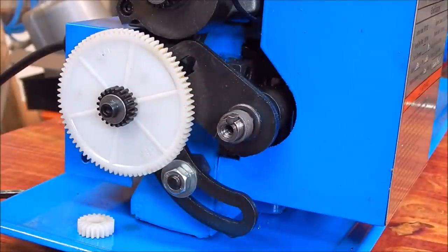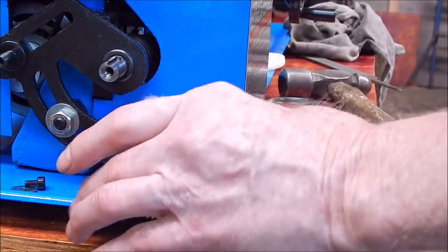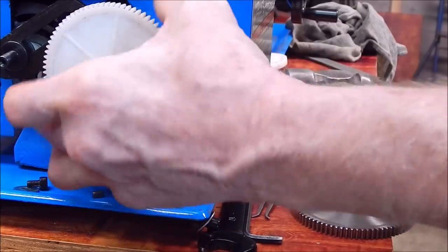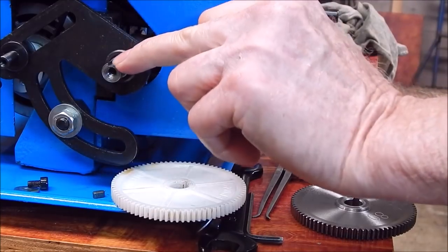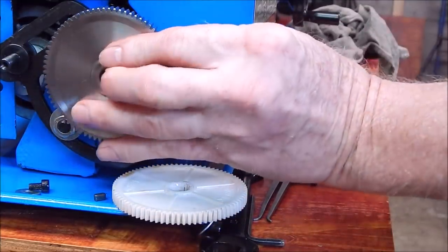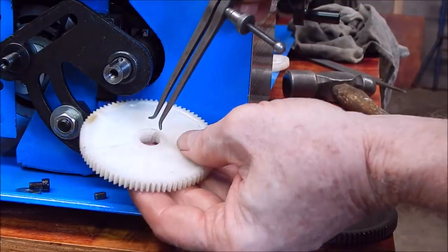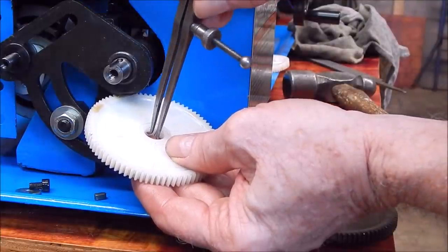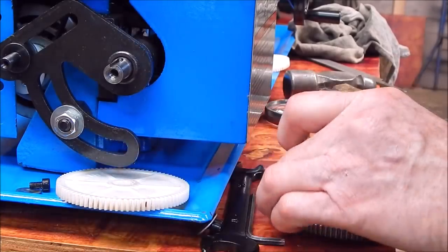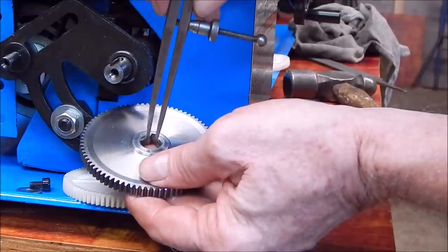Okay, let's get an 80 tooth and put it on. Well, we've got a problem - this isn't as easy a job as I expected. This original nylon pulley goes on and fits just beautifully, just a bit of wiggle room, so that's the perfect fit. There was a little bit of a burr on the edge of the keyway - I filed that off and it hasn't made any difference. But this won't go on because it's a little bit too undersized in the middle. Using the dividers - this is always a good way to feel the tightness of things. You can feel the friction on that - that's a good fit, that's perfect. Now if we run it through here, it doesn't want to go in. So this is definitely undersized, needs opening up.